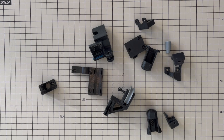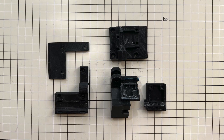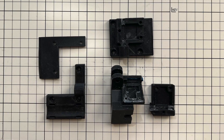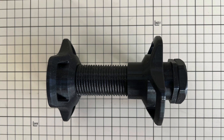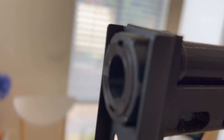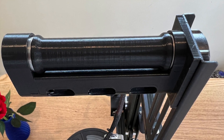I also tried different filament guides, but I won't recommend any of them because none of them are really necessary. For filament sensors, I've never had a good time using them — with a filament sensor installed, it adds extra friction all the time, just for handling a very rare case which can be avoided by some simple calculation. I also don't like fancy filament holders with screws; you'll figure out the reason when you change your filament frequently. The modded version with a cover on the bearings works the best for me — don't print the original design as it tends to fall out of the mount and break easily.